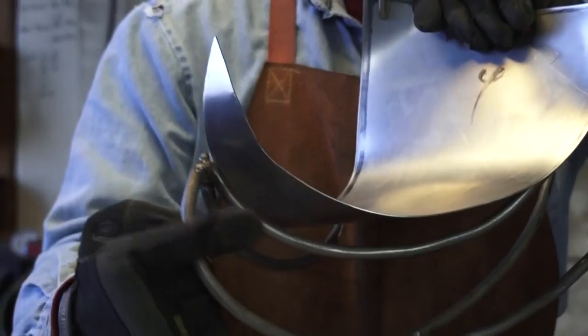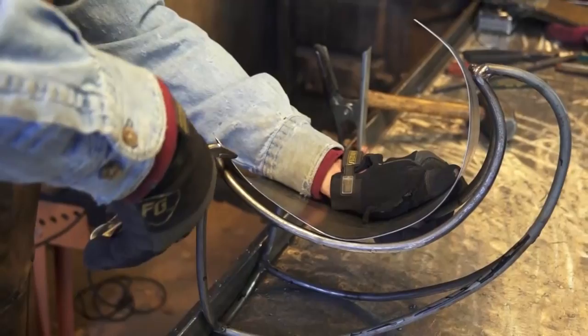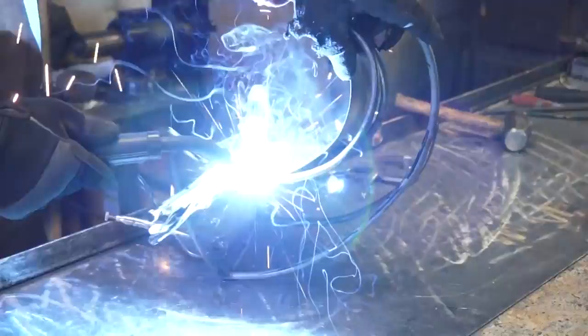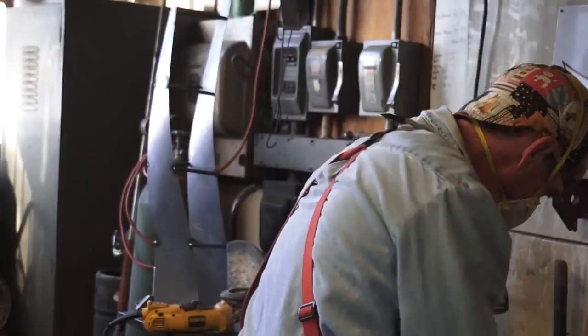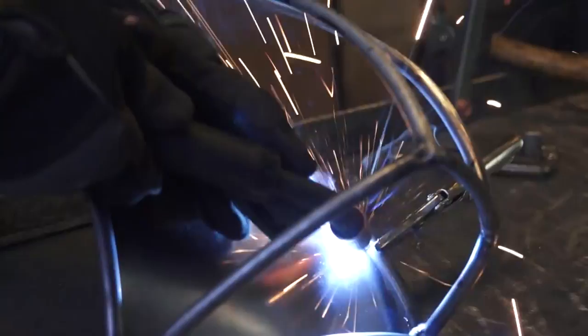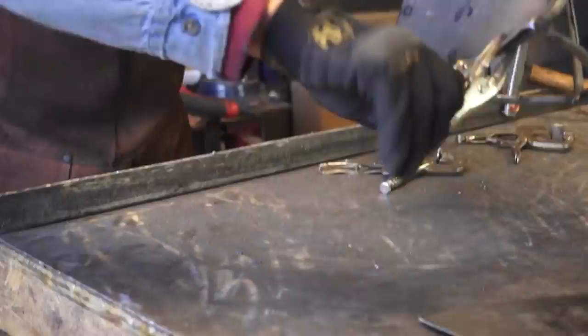You can see I'm watching this edge right here, and this is going to be hanging wide — we'll cut it off after we weld it on. Make sure your sheet metal is perfectly aligned before you make your first tack weld. Use your vise grips or pliers to begin pulling the sheet metal to the frame. Start your tack weld on the solid frame, drawing your pool to the sheet metal.